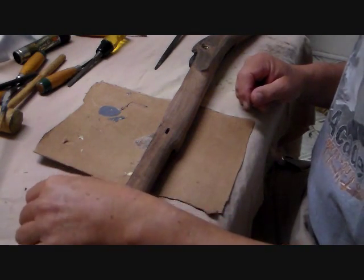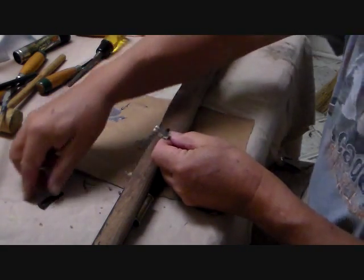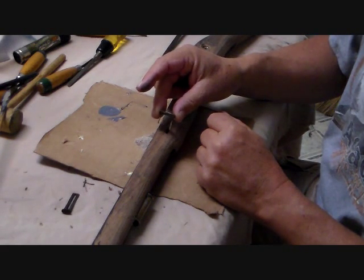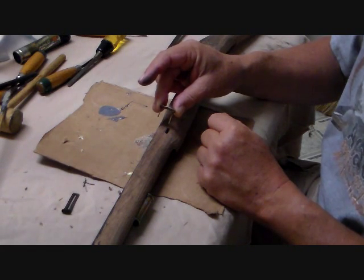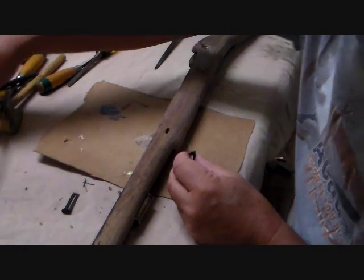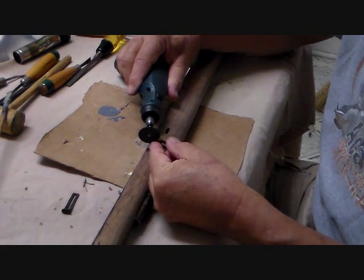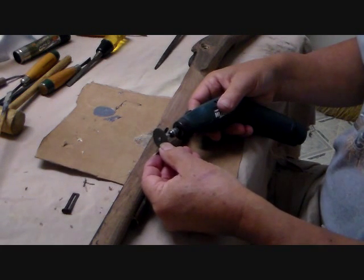One bit of fussy stuff with the Brunswick rifle are these brass pieces here, through which the barrel wedges pass. Now, as you can see, this has two long brass spikes that went quite deep into the stock. Well, with this cured wood, it's pretty dodgy to try to drive these things, particularly since I've got fiberglass on the inside. So the first thing we're going to do is trim these a bit. They're altogether too long. So we're going to cut them off about here. So we're making little chisel points here.